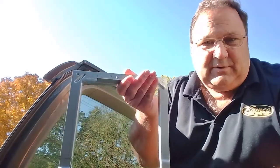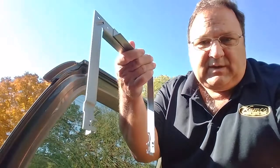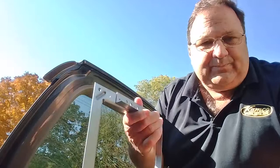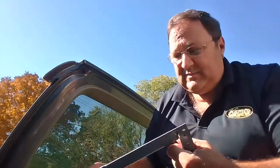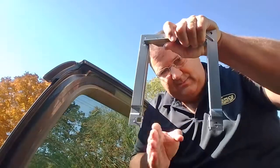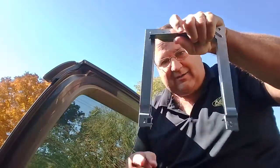I've got a bucket of clips with me all the time. Some of these clips you've seen before, and some you may not have. When you can go around a light fixture or heating bar by using a clip like this — it's called a yoke — it'll save you so much time. You run your mains right through, put this clip on, then cut the main runner out at the size you want after you put the clip on. There are all kinds of ways to do this.